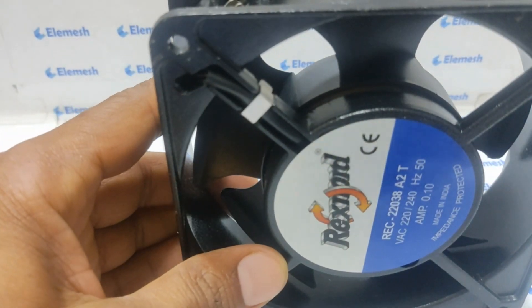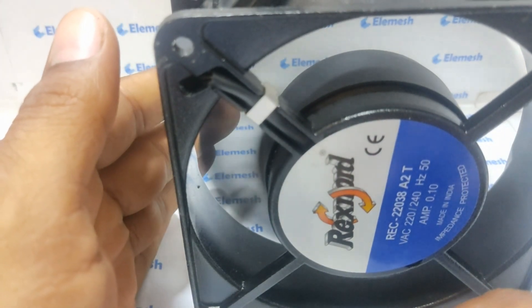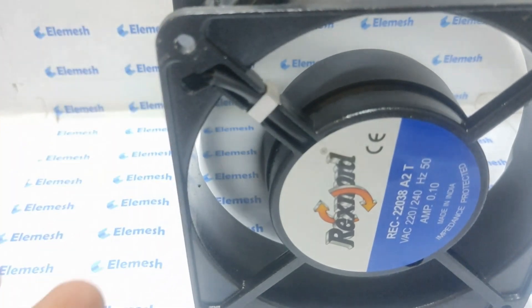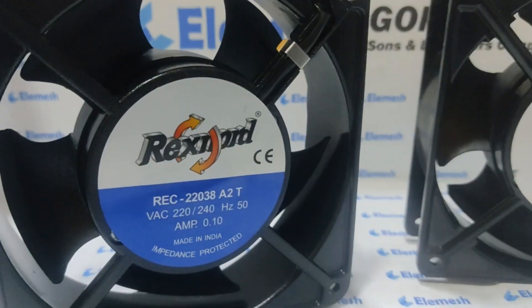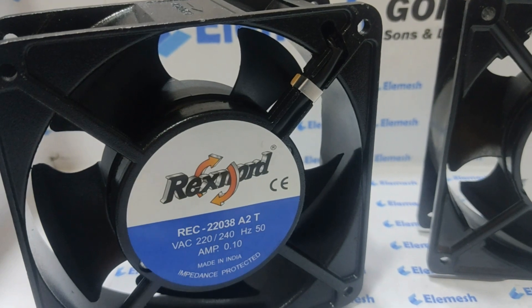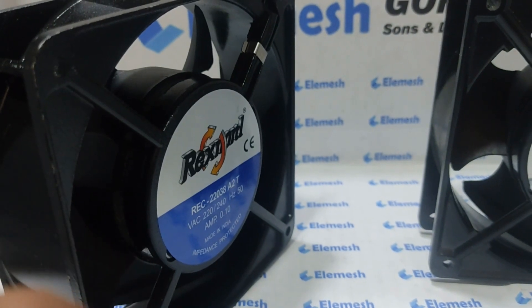This is a sleeve bearing fan. Now you have heard the noise of both fans. When you are going to buy them, check the noise as per the size of the fan. The bigger the size, the bigger the noise for ball bearing. If you are using them in an office, or in a factory where noise is more, or on the rooftop, you can use high-noise fans — they will exhaust most of your inside air to outside with high RPM.